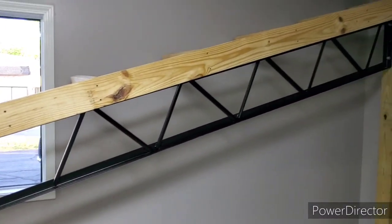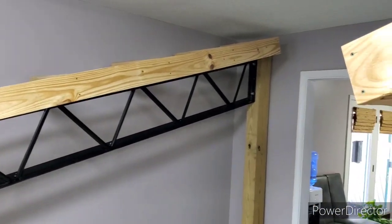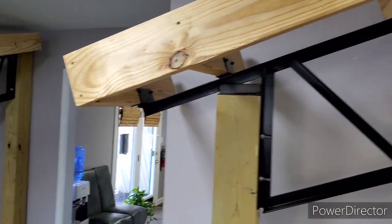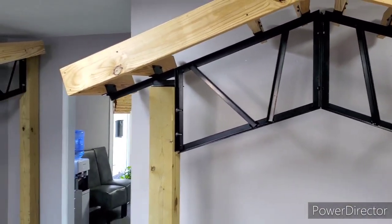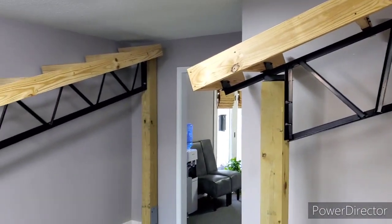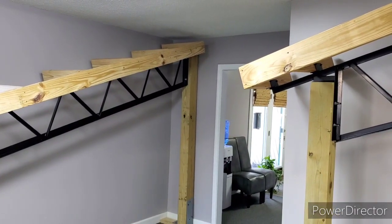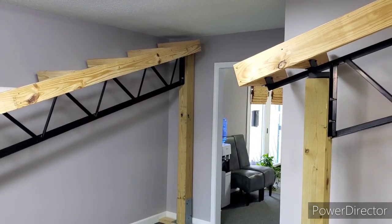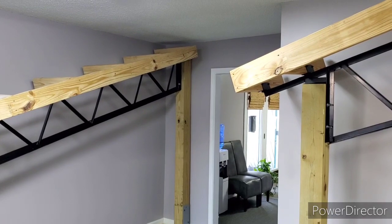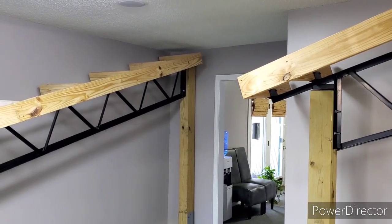All the lean trusses, we go up to 30 foot on those. All our trusses are agricultural. We've got prints on our trusses for snow loads and wind shear, and they're made to international codes. But check with your local building inspectors and verify everything. We give the prints away, and most of the time we send them all over the country and they can sign off on that — they're made to international codes for welding and those kind of things.